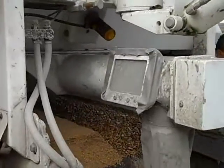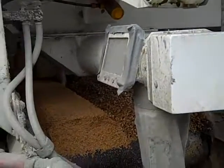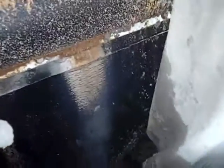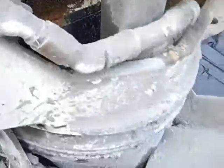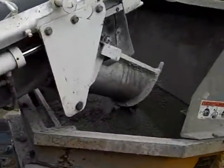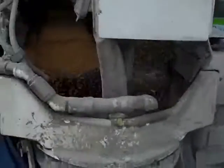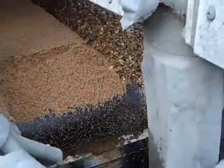The back of this truck, of course we stopped mixing right now. You can see we've got aggregate on the right-hand side. There's the sand right there. The water's coming in from these tubes. Everything's jumping down to the bottom there, and that auger is pushing everything right up top, dumping it all in the back of this line truck right here. And this line truck has a big old auger that's sending it through this tube that we've got snaking through the house. Oh, here we go. Now it's mixing. Oh, I just missed it. So that's how it's made.